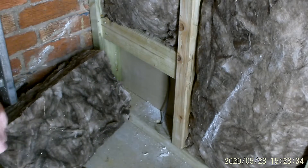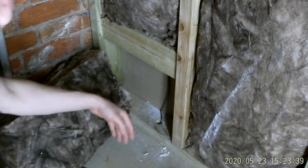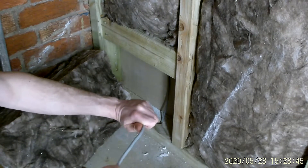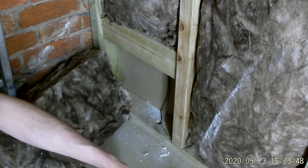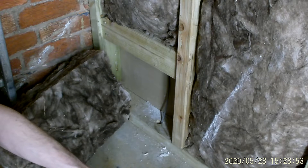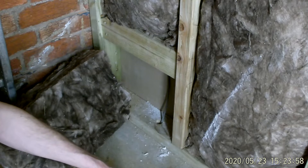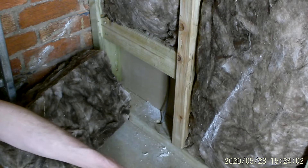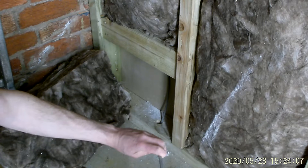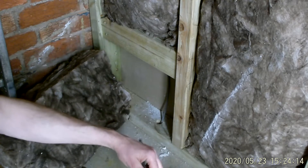The other thing to remember is that this is quite a short distance, and the amount of current going through this circuit - being a socket circuit in a bedroom - is going to be very minimal. You're probably powering a couple of clocks and a bedside light. When you get on to bigger appliances like immersion heaters, ovens, and cookers, that's when you really want to start thinking about the difference this makes.